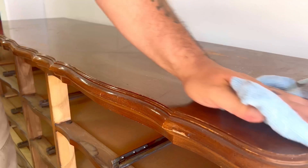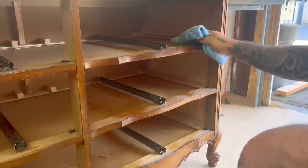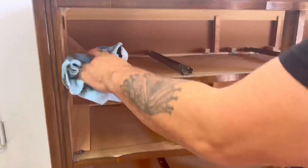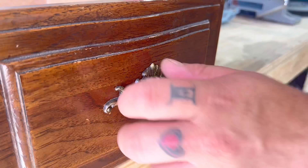Cleaning is a very important step because it saves your sanding pads from getting gunked up with all that dirt and debris, and it keeps you from digging it into the wood. It also shows the customer that you really did take your time by cleaning the inside and the out, so that they get a premium product when you go to deliver it.